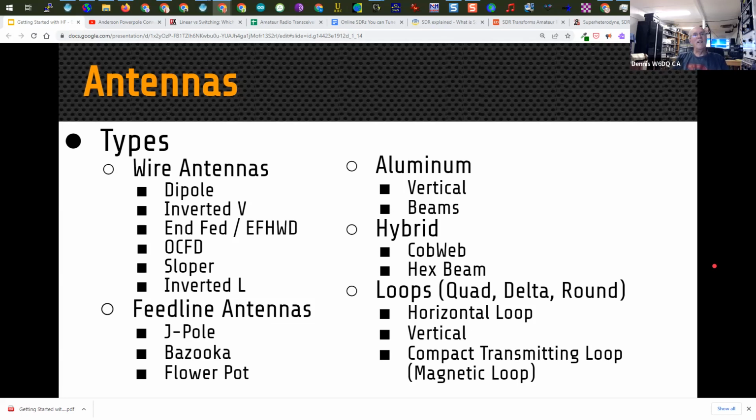So very, very interesting antenna. There are a lot of wires, so they've got a lot of capture area. You get good receive signal strength, because you've got so much wire up in the air. Horizontal loops are great. And that particular one covers 160 meters through 10 meters, all bands, just with a tuner, piece of cake.